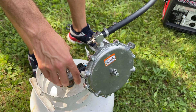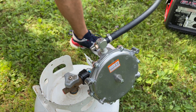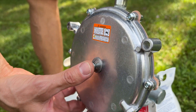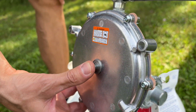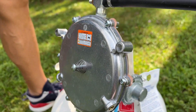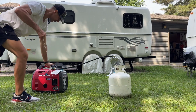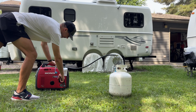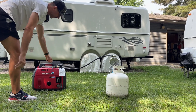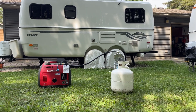We'll connect the propane tank regulator to the propane tank that comes along with this — it does need to stay in the upright position the whole time it's in use, so make sure it's positioned upright. You can use your quick connect to connect it to the generator. They do say to keep the propane tank about two to three feet away from the generator and never behind the generator. Now we're ready to turn the propane tank on, and then we're going to have to prime this regulator three times — press it slowly, and you'll hear a hiss each time. And just like that, we have a generator running off propane.